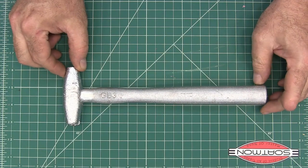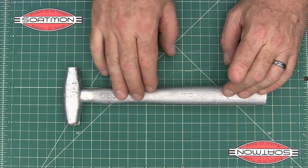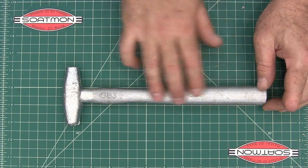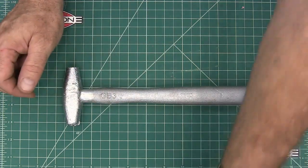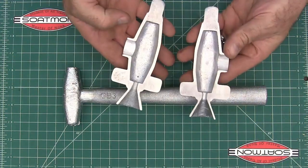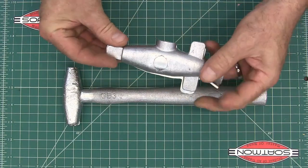This is what we're gonna make today. It's a lead hammer and it's got an aluminum handle. I made a 3D pattern in order to pour the handle. So I make up a sand mold and then pour that in aluminum. And then I have to have a mold to pour the head. And so this is a permanent mold that I made